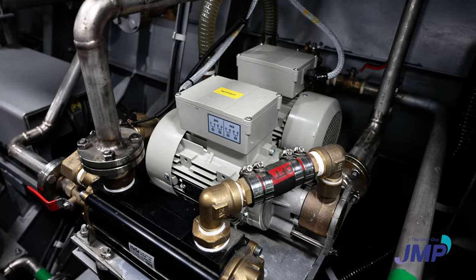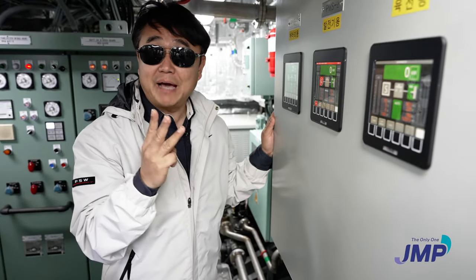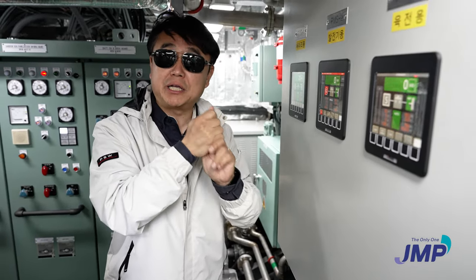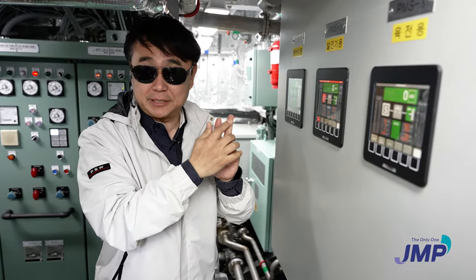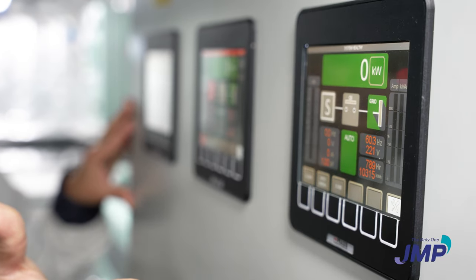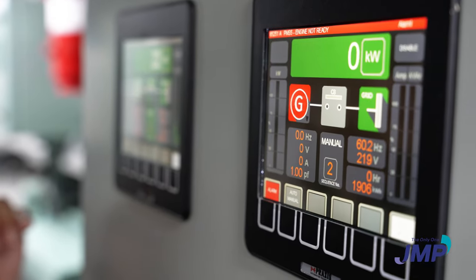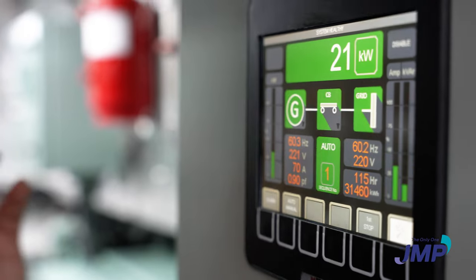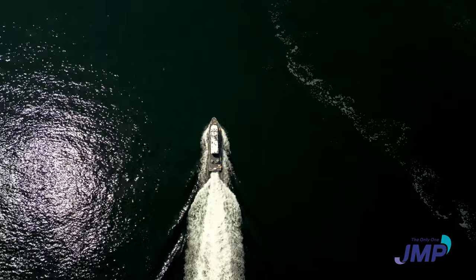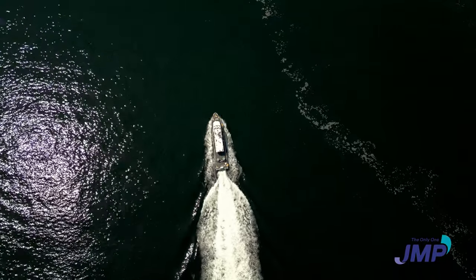This is a cooling kit. And this is the power management system. We have three energy sources: number one, shore power; number two, generators; number three, batteries. The batteries, generators, and shore power all connect here with switching. Shore power charges the batteries, and the generators also charge the batteries. We then use the battery power for hotel loads and electric propulsion. This is a very important system for the electric hybrid propulsion system.